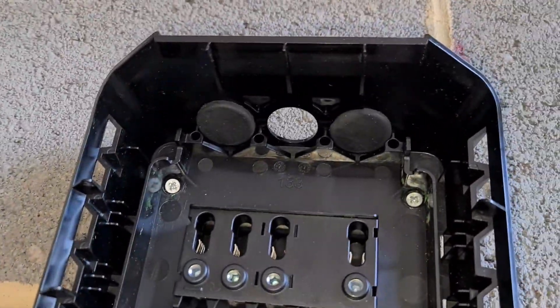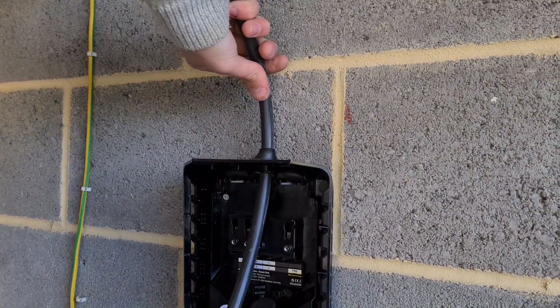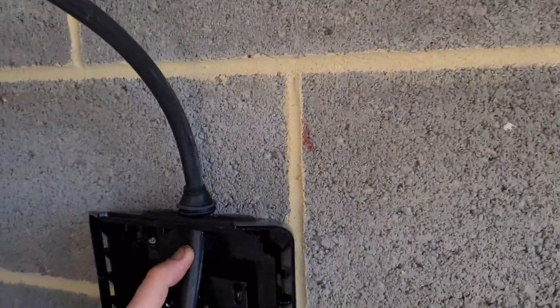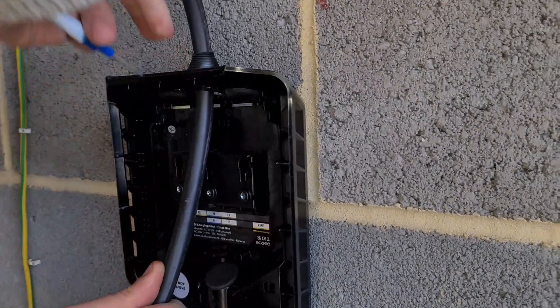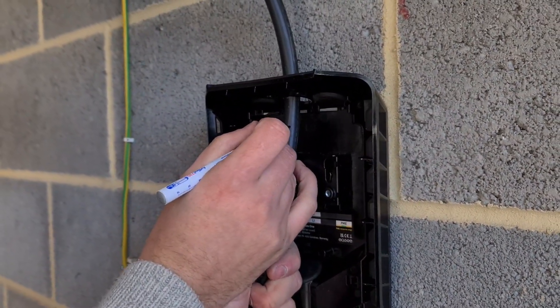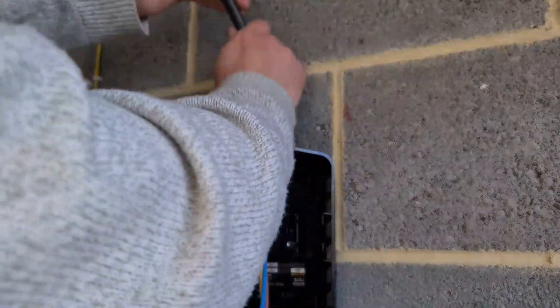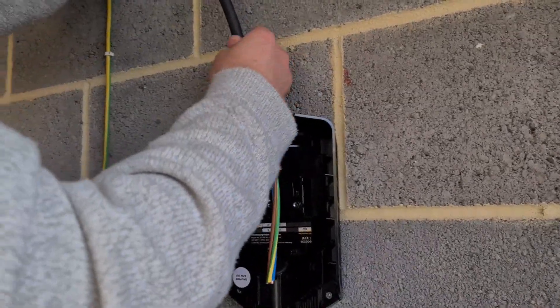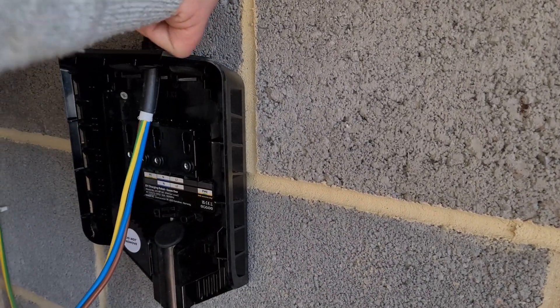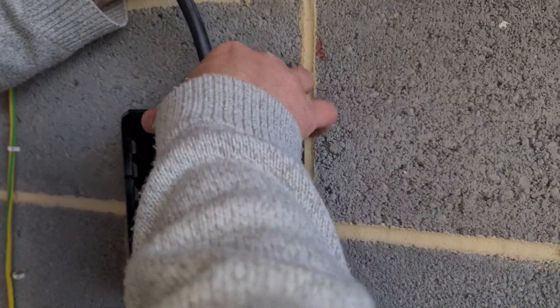With the cable dropping in, he's trying it out to see how much he needs to strip, popping it in and making a mark before stripping. We've got NYY cable on this one going straight into the charge point — there's no CT clamp. We've got a 100 amp main service fuse and the load from the consumer unit is at a low enough level that overconsumption isn't a concern. The grommet is nice and tight around the cable — it looks like Matthew may have caught his hand there, so he should really have his gloves on.